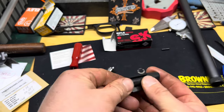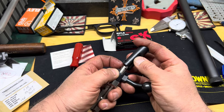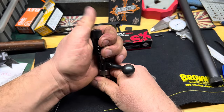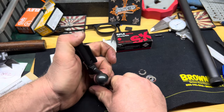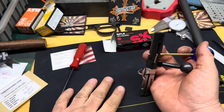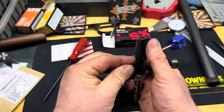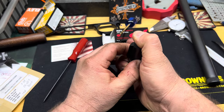The smaller side of the cocked indicator goes into the bolt shroud so it can pop out that hole. With everything in the same position as when you disassembled it, push the bolt shroud back on. Use your push punch to line it up until you get the pin started. Remember to push down on the bolt shroud to release the remaining spring tension, then the pin fits right back in.